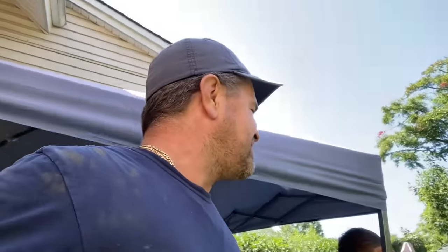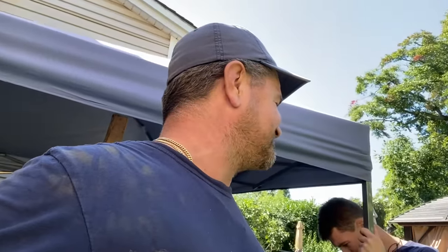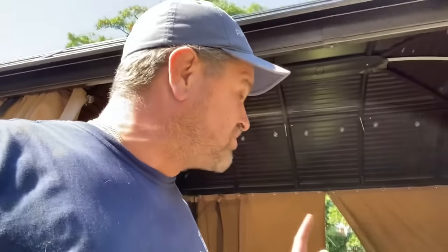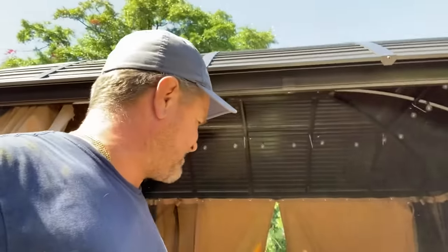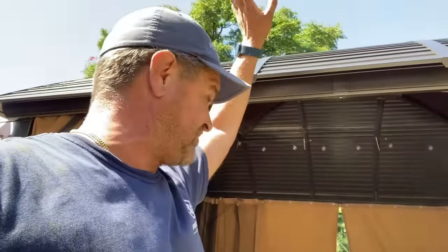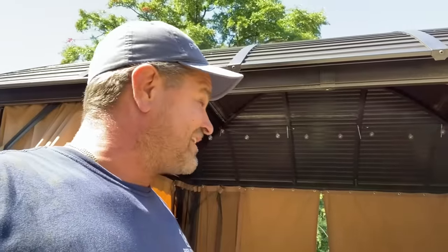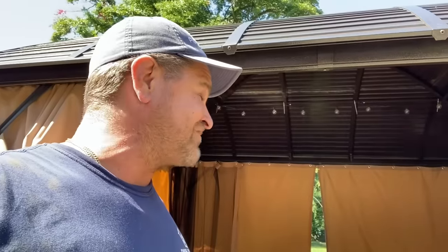Do you know that an expansion tank cannot be supported solely by the pipe that it's attached to? So imagine you had 3/4 over a domestic thermal expansion tank, for example. Let's say you have a piece of 3/4 running across overhead of an unfinished basement, which is properly secured, and I cut in a T to hang an ST12. The ST12 cannot solely rely on that pipe for its support. That's according to the International Plumbing Code. Wow.